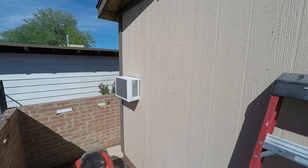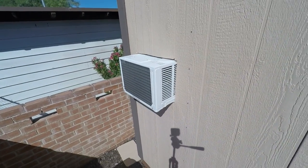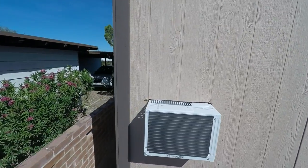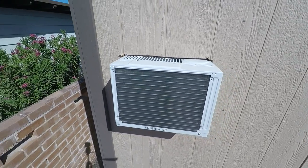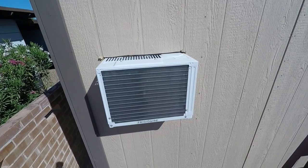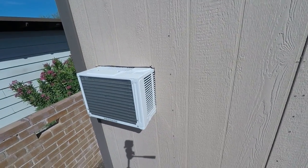I came out to the back side to make sure I'm going to cover up all the seams — making sure nothing gets into those cracks I made initially with the reciprocating saw. I want everything filled up so no water gets in and no bugs get in. They won't pass the silicone or caulking I put on the inside, but I don't want them in the wall, so I want this completely sealed.